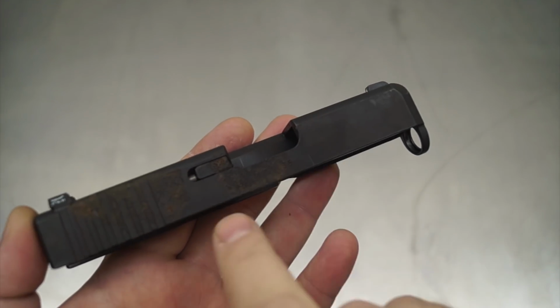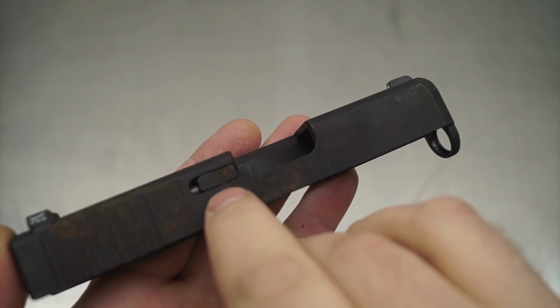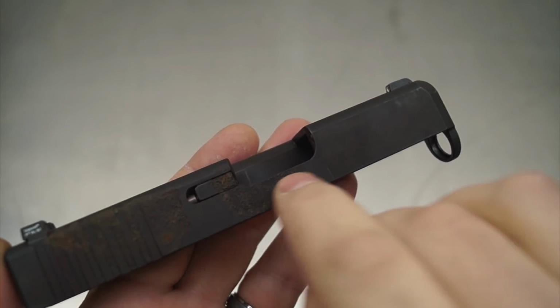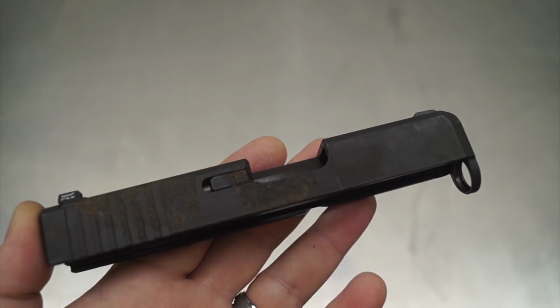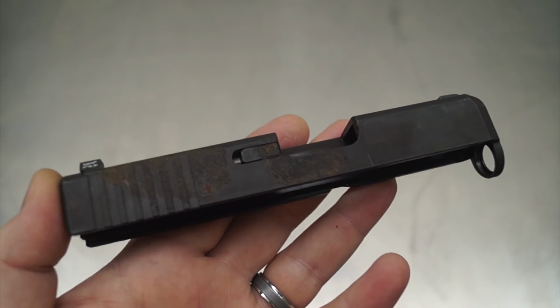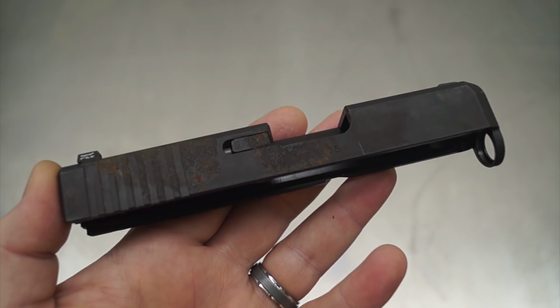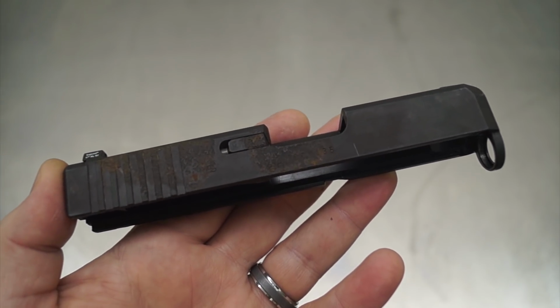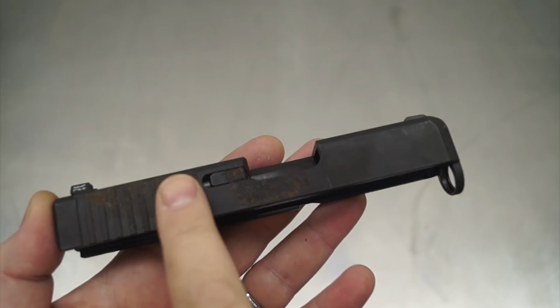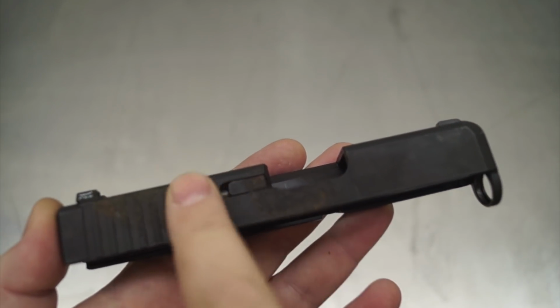We kind of work around it, and because we work around it, we are still going to have a little bit of pitting left over on this edge. It's probably going to be something around a 16th. We'll come back over in this raised zone. What we'll do is knock that down with an end mill, hopefully just taking off enough to remove that. We'll still see that border outline, but we won't have any of the pitting on the top side. So that should fix our issue pretty much in here.